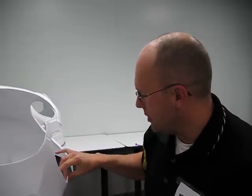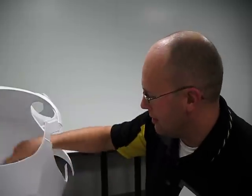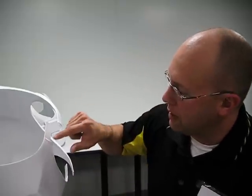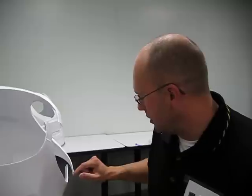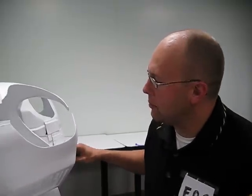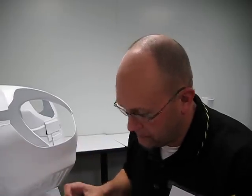But we went ahead and shimmed out the shoulders and the sides on the back piece first because that's where we did our cutting. We want the front to hold the shape as much as possible. I've gone ahead and glued one side together just so it's easier for me to show you the last 3 steps in sequence. I've ground down all of my seams where the glue had squeezed through, ground it down flat. So now we're ready to go ahead and meet those angles up.